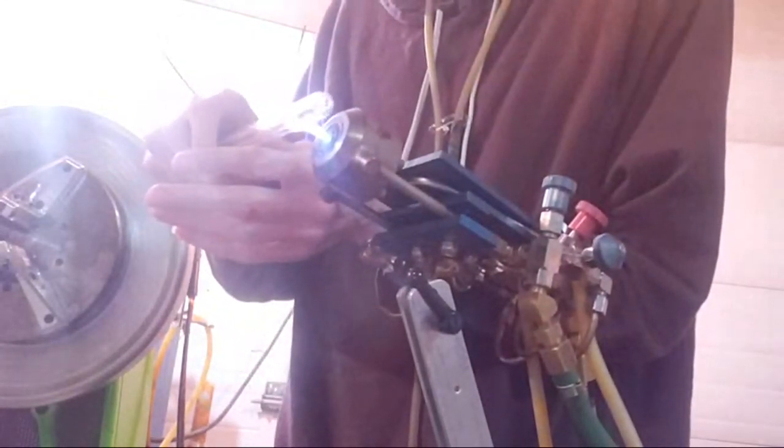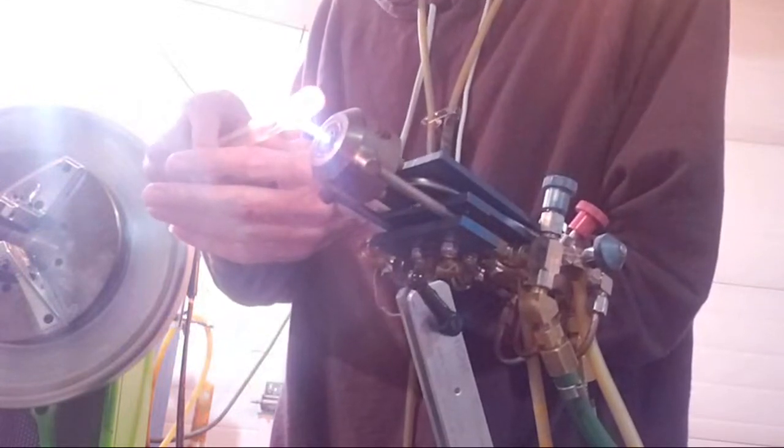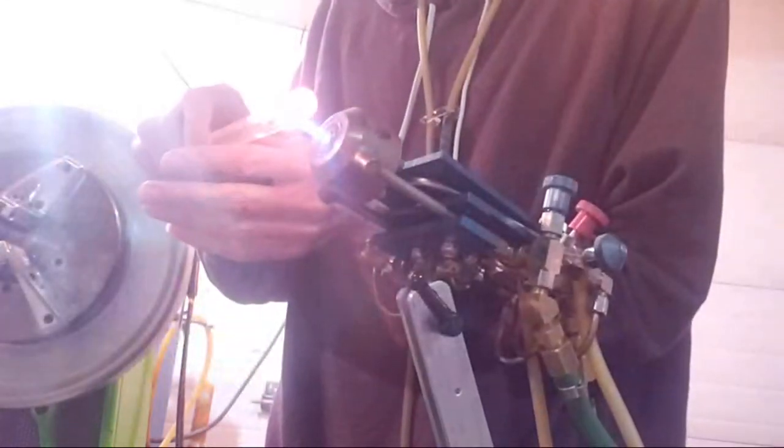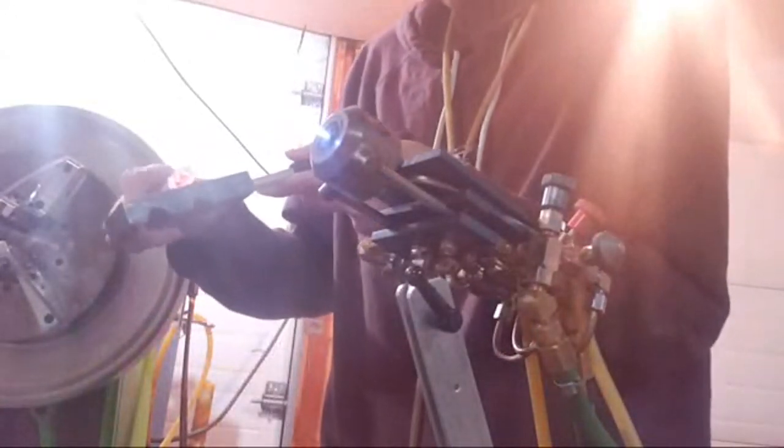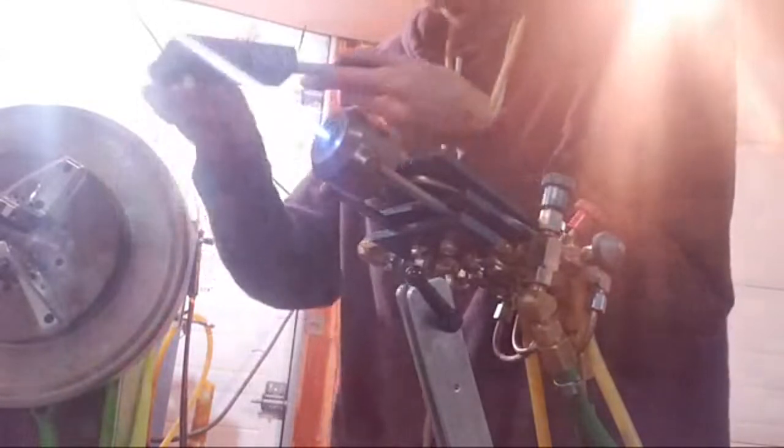And I'm going to spin it as evenly and consistently inside the flame as I can, trying to only heat up as small of an area as I can. As I do this, the glass is going to restrict on itself, and it's a little bit deceiving because after it starts constricting, when you take it out of the flame, it's going to constrict a tiny bit more. So I pull it out before I think it's done, and I actually just smooth out the outside edge, and then I take a look at it and reevaluate it and decide if it's good enough.